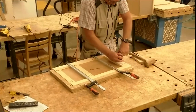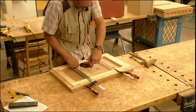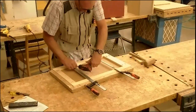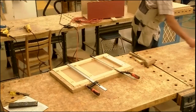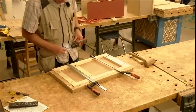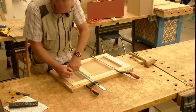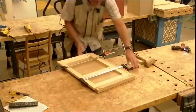Especially in pine. If you're doing this in maple or oak, some of the harder materials we have here, this can be a real pain. At times you may need to drive it a little ways, back it out, drive it in a little more, back it out, because the screws that we use are self-tapping screws. There's a tiny little slit in the tip of the screw that helps it to pre-drill its own hole. So, and then we go last one. All right. So there's our screws.